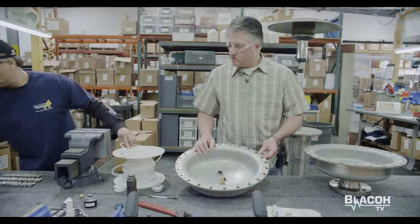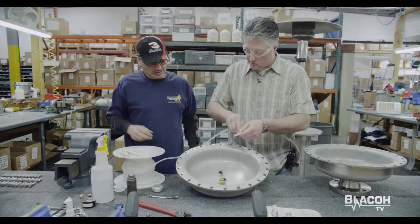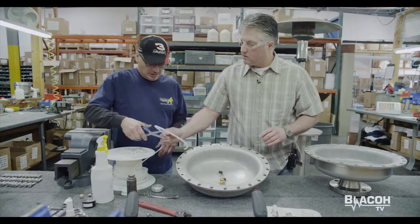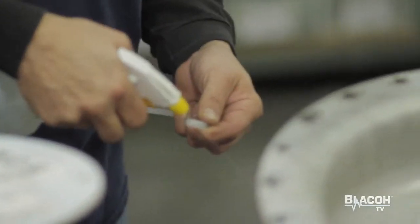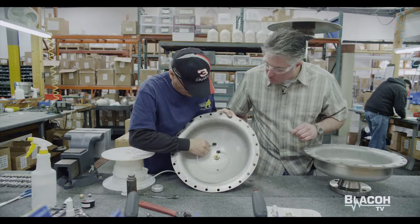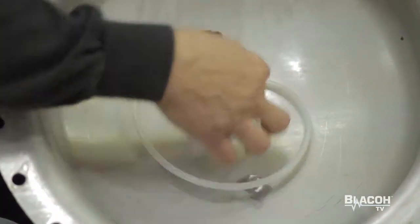Now there isn't a specific length we always use for the quarter-inch vinyl tubing, but what we do is measure out so you'll have a nice sweep. You don't want too much tension or you'll kink the hose — once you kink the hose it will be damaged. What he's going to do is wet each end. In order to create a nice firm fit we wet the ends, which also helps it seal better. It's just push connections hand tight and he makes a nice sweep, then lays it down flush with the body to contour with the body.